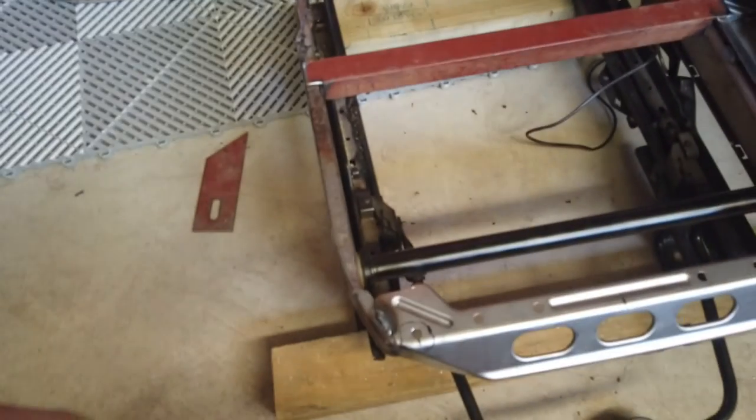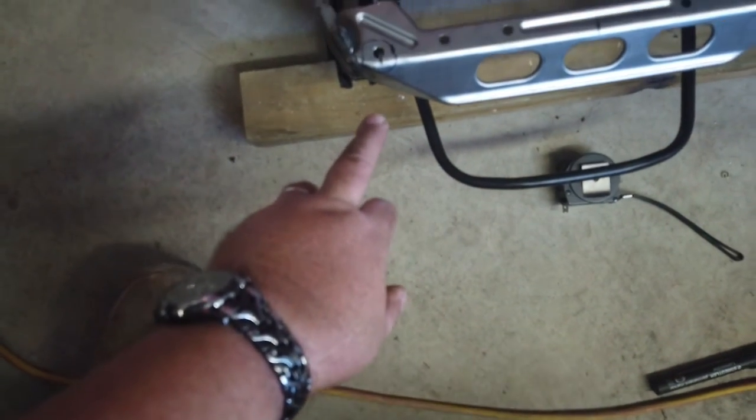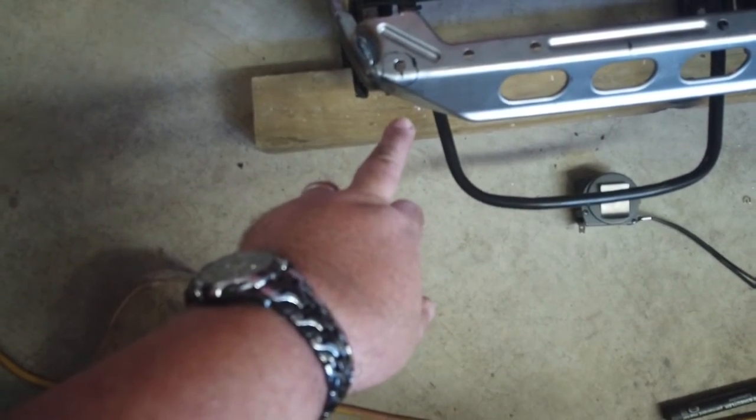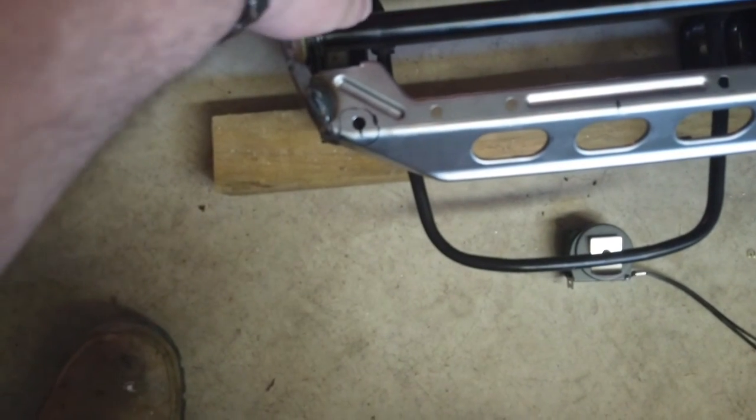But then, if it needs to go up anymore, like I said, I just need to put some spacers in and get some of these bolts that are a bit longer. I doubt very much you'd need to go forward anymore. If she'd have to go forward, I would have to weld a flat bar from there, to overlap the front. Anyway, it wouldn't really matter. It still needs to be welded into place, and then I could drill a hole into the flat bar there.